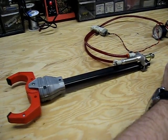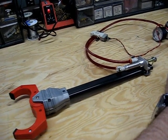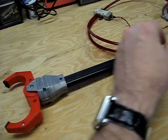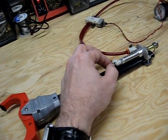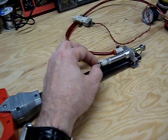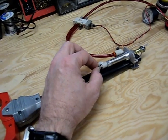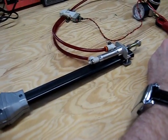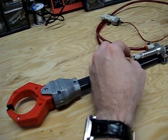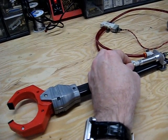So now I'm going to go ahead and operate this whole thing so you can actually see it run. When I press the button down, you'll see that it will actually close the claw, and then when I release the button, it opens the claw. You can see this is going very quickly — it closes very fast. So if I come in here and actually tighten this down, this will adjust how quickly the air is allowed to be vented from the chamber. I've got it tightened all the way down, so now we should be able to close the claw, but when I release it, you'll see it'll open very slowly, or hardly at all, until I open this up a little bit. This will adjust how quickly the claw retracts.